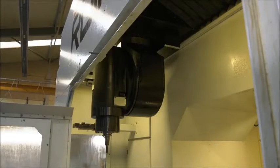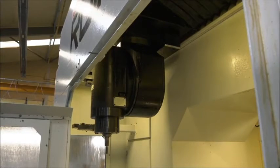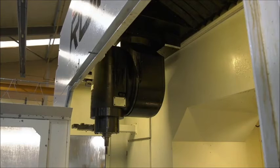And the clever bit is when you rotate that head through an M code, the way the machine's been set up and the kinematic model inside the machine, if you were to write some code or a program for an A-axis machine, you rotate the head and internally it will do all the rotations, and basically you can use it as a virtual B-axis machine without changing any code at all. So Graham, is it safe to say that this machine is pretty unique? Absolutely, absolutely.